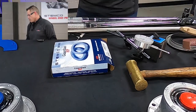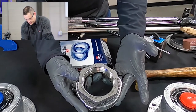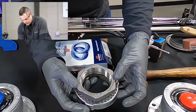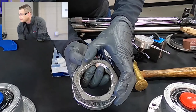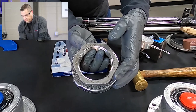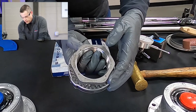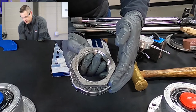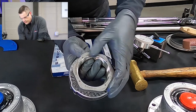To recap the ZipTorque nut: you can see the indicators on here for the final back-off. Also on here you can see our website — stemco.com/211 — which will take you to a YouTube video showing the installation procedure for this nut. The 2-1-1 procedure is: 200 foot-pounds while spinning three times, 100 foot-pounds while spinning three times, and then one face mark back.